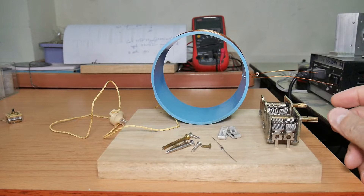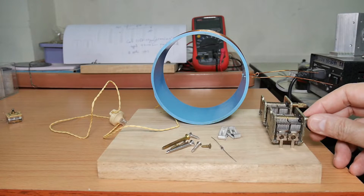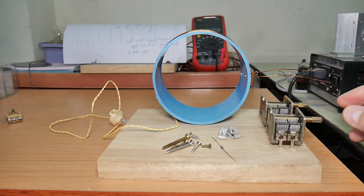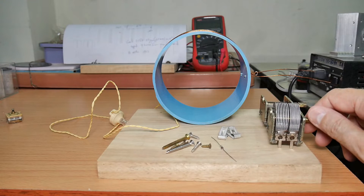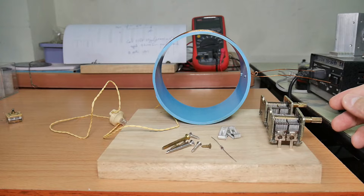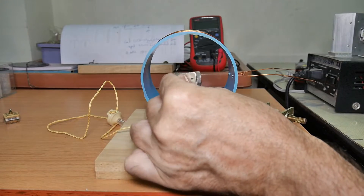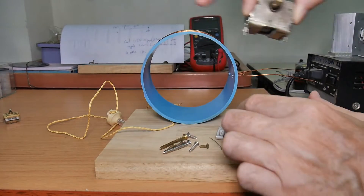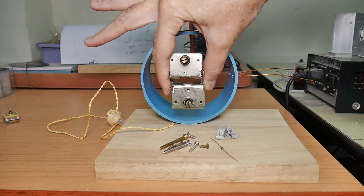One board layout I'm thinking about is to put both capacitors on the right side because I'm right-handed and I can go from one tuning capacitor to the other pretty easily. The disadvantage is that these capacitors are going to be exposed to mechanical impacts — people bumping it, hitting it — and they're going to be exposed to dust. So that's a serious drawback. Another option would be to mount them inside, one above the other, so the coil helps protect the capacitors.